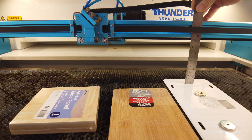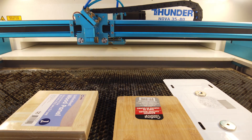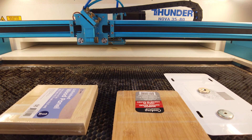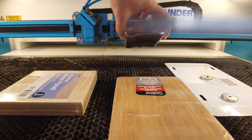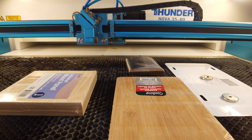I'm going to measure from the top part of the gantry. You want to make sure that none of the pieces are in the path of the sensor, no magnets or holding devices are in the path of it, and you do want to make sure your material is in the path of it. The sensor is pretty sensitive and it can actually detect underneath if there's a gap — that's why something with a gap underneath would not be a good idea, as it can see through.